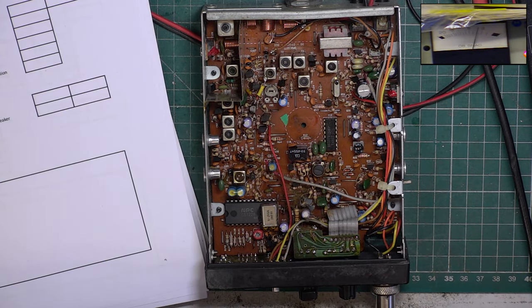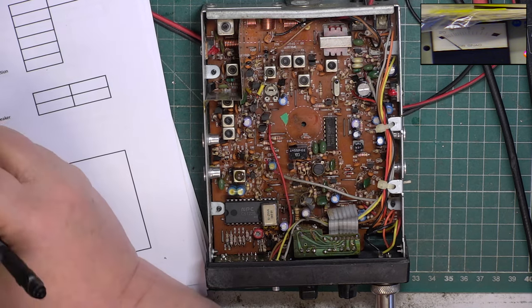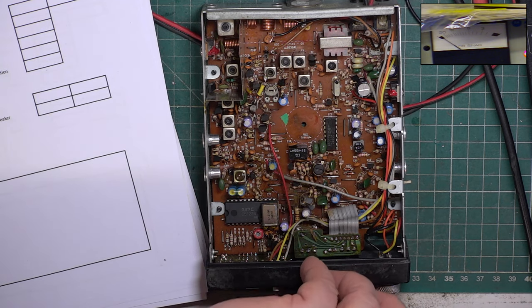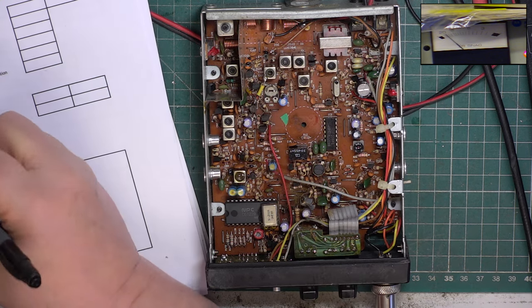Squelch to 4, I'm going to put the signal generator to 100 microvolts. Put the squelch to 4, not the volume. And the full squelch isn't that far out, and there's no hard and fast rule about this anyway. But it's 240 microvolts. Tight squelch, and let's go down to threshold. It's about 1 microvolt.